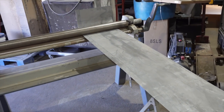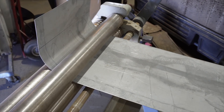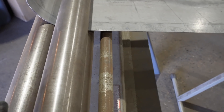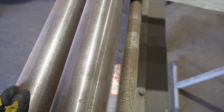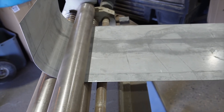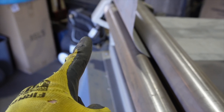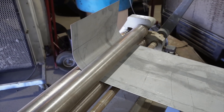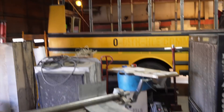We've worked our magic and ran it through the slip roll — it's kind of like a pasta machine for steel. It's called a tri-roller slip roll, or pyramid roller. You've got a roller here, roller here, roller here. You adjust the distance of the upper roller by tightening the screws, and it lets you get a shape on the steel. I think we hit our lines pretty well, so we're going to do a test fit with Mr. Holter and see how it looks.